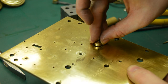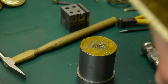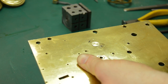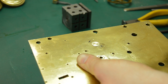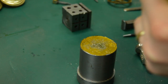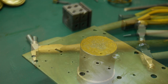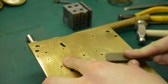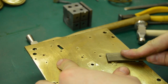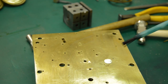In this case I'm actually plugging the hole rather than making a bushing, because I'm fairly certain that the centre of this is not quite right — it's worn its way down and elongated quite a long way. With a fusee, or with a great wheel on a long case clock, it's important that the winding arbor actually comes out centre to the dial winding hole, because you can't do much about the dial. If you confidently go about bushing the plate and then come to put the dial on and realise that your winding arbor is no longer in the centre of the winding hole, then you've got problems. So if there's any doubt, I use this method.